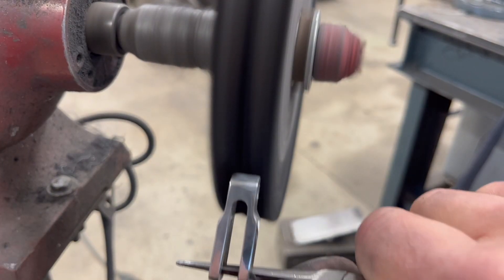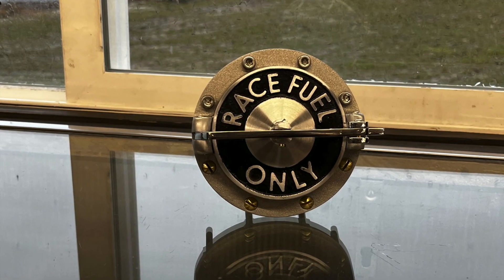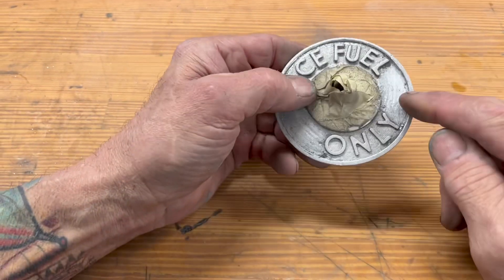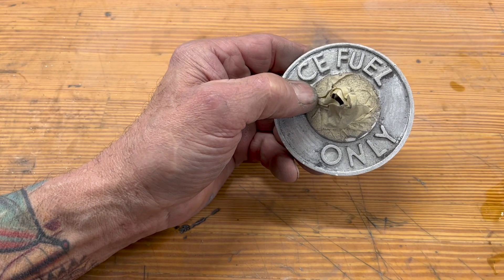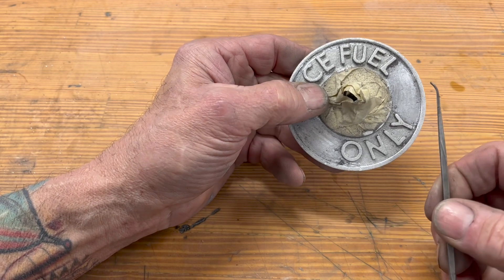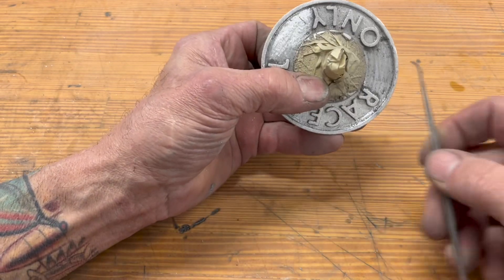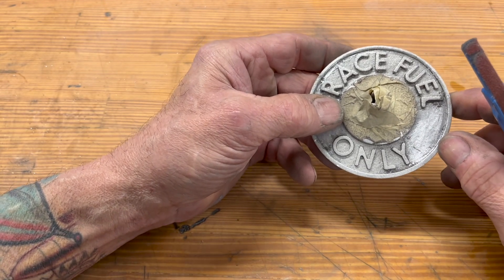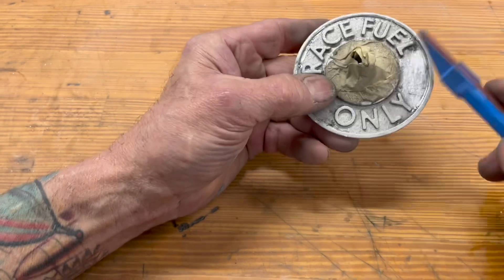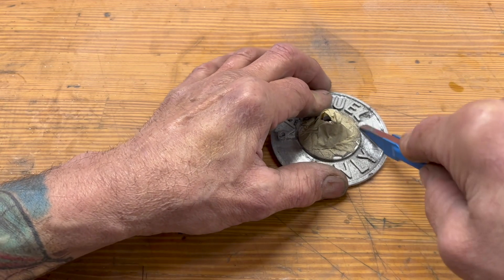These arms have come a long way since I cut them — a lot of work went into them. There's the hinge block, get that a quick polish. I tried it in black and it looked okay, but I'm working out some of the little stickers — those are little chunks of aluminum from the casting process. I've got a couple little files to get in there and clean up this area. Then I'm going to use my split shot in my blast cabinet to put that cast finish back on.